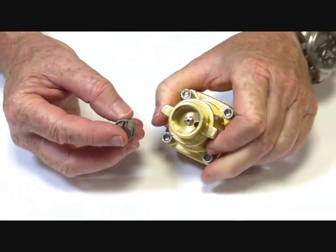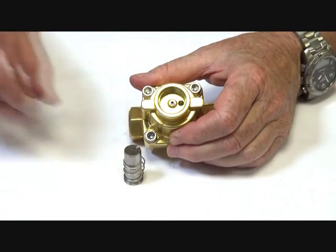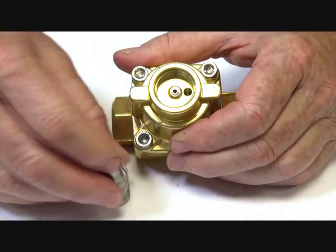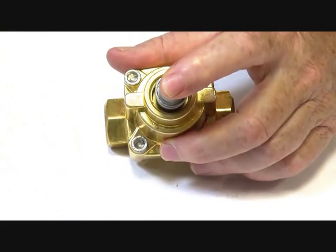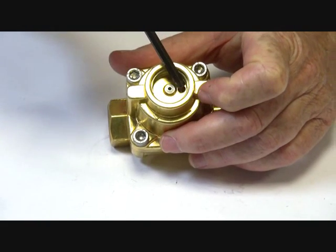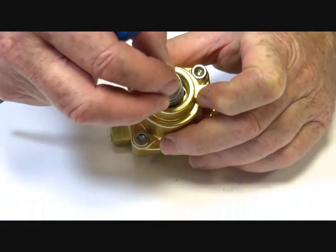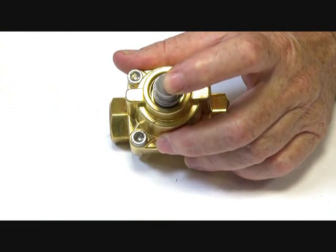All 316 trim on the brass valve. There is a seat inside here which is a stainless steel teflon seat, that sits firmly on top with the action of the spring. The media comes in through the inlet port and through the side hole here, and sits on top of the seat, which assists the closing. So the spring plus the media pressure keeps the unit closed.